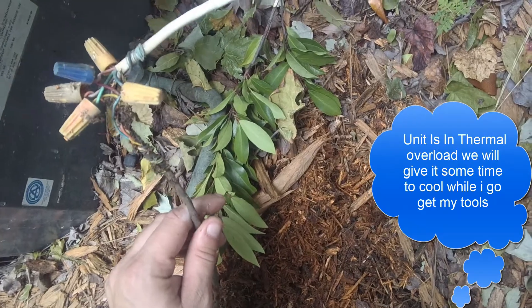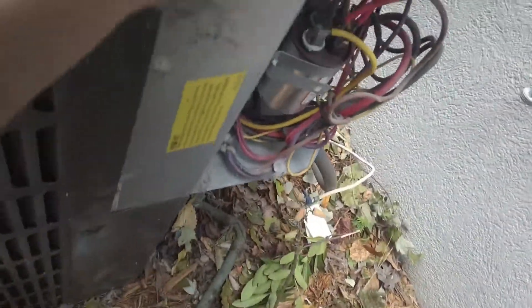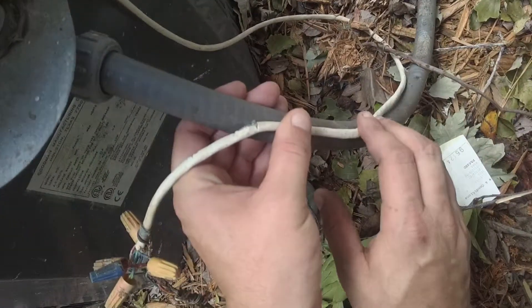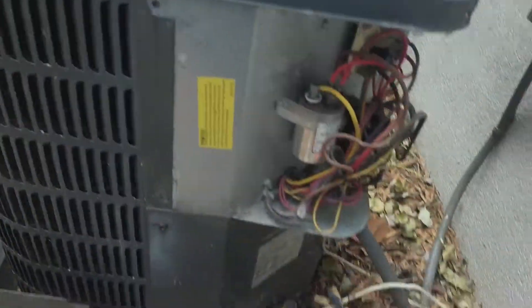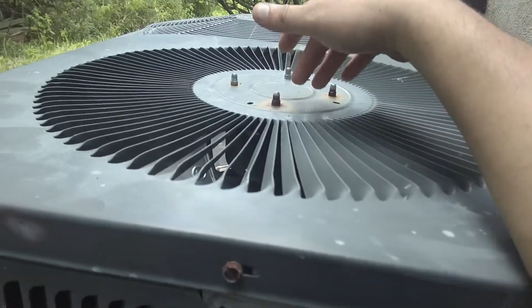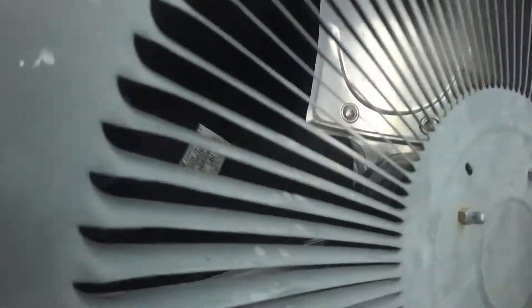So we'll dive deeper into this situation. Besides the crap being in the dirt, that's probably not our problem. I forgot to bring my lock straps. The air conditioning guy is actually here right now, but since this is pulled in, I don't think this is gonna be our problem. What I think our problem is — this is a non-OEM motor for a Goodman unit, and it is way under horsepower. It doesn't match these bolt holes, which it should. This is a tiny little motor, man.